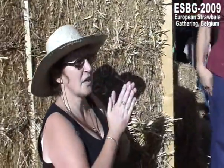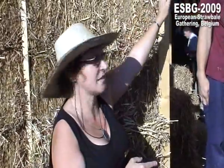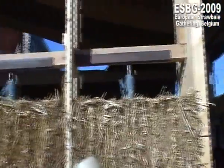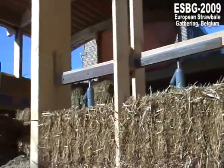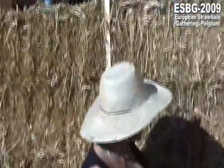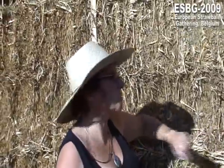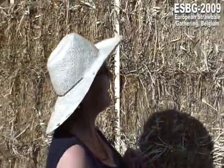So with all that much wood in it, like the 2 beams, we've got so much more thermal bridges. So we want to minimize that. So this way it's the minimum amount of wood. Not only for the thermal bridge, but also for the money. Wood has got a lot more expensive the last years, so we are trying to cut down on costs too. By this system, we use only half the amount of wood than the traditional system.